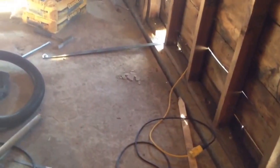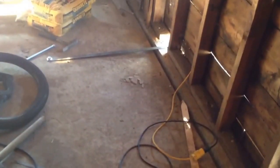We attached these flat bars in it. The flat bars are a little off the floor, because I'm thinking the wall will settle once we've tipped it up. It's on a little different type of footing, and I think the wall will settle along to the corner and possibly go back down a bit. But that'll hold it in anyway.